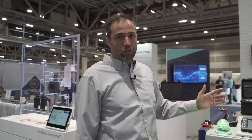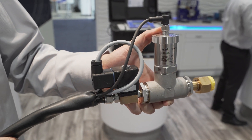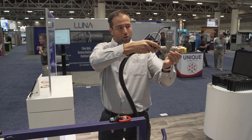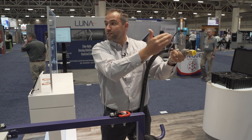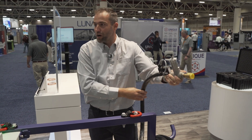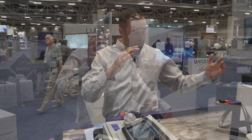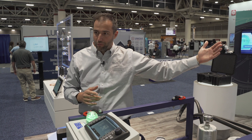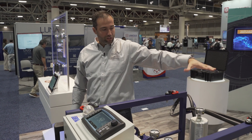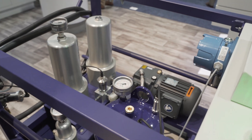You take this hose connected to the filling port of your gas compartment, screw it there — it's completely sealed — and the sensor detects the humidity content in your asset. It will take a small amount of SF6. Then this machine will take out some gas out of the compartment, it will move it through these filters, and measure the humidity content before and after the filter.